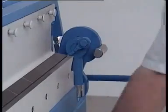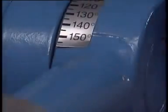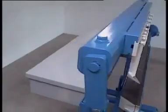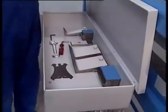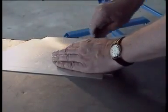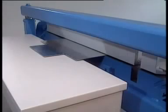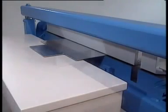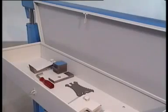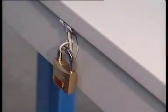For repetitive bendings, an angle stop can be set on the bending beam. The angle can be read easily off the scale. Appropriate tools such as the fork and the Allen screw are in the toolbox on every machine, which also has space for extra segments and useful scoring patterns. These do parallel scores at a distance of 0.20 to 3.9 inches along the workpiece edge. The toolbox can also be used as a sheet metal support, set up either parallel to the bending beam or lowered according to the strength of the lower beam cheek segments. Of course, you can completely dismantle the toolbox or lock it up from intruders.